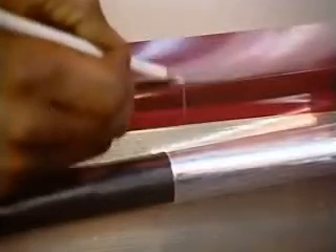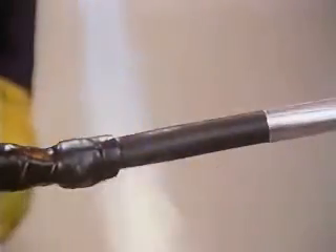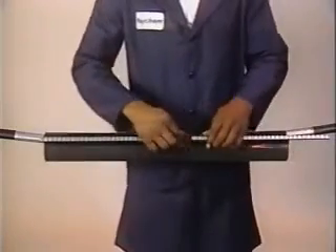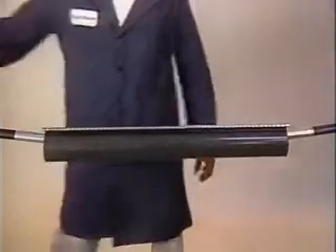The rest of the installation steps — including cleaning and scuffing, the application of four-inch aluminum tape, measuring and sleeve selection, sleeve and channel trimming, and flame treating — are identical to the standard polyethylene cable installation. When the sleeve is assembled over the prepared area, the channel must be rotated at least 90 degrees from the position of the bond bar.